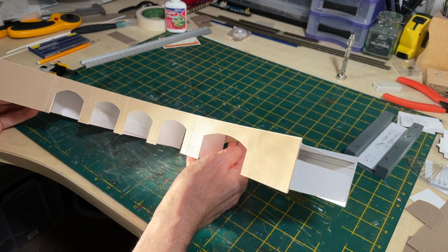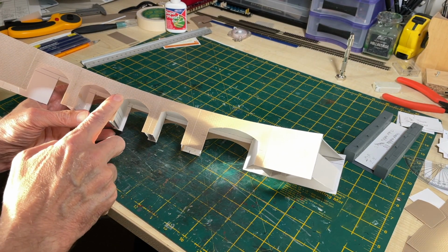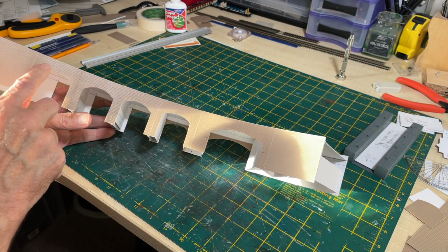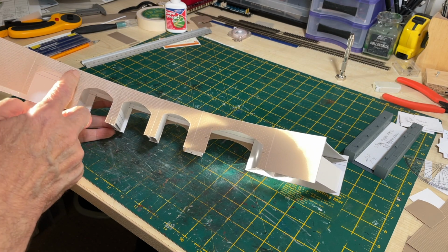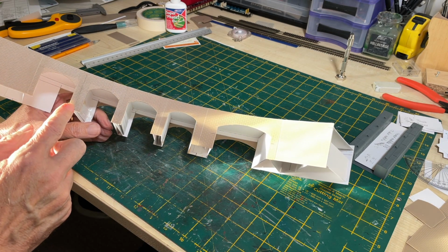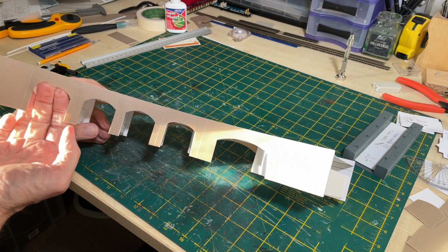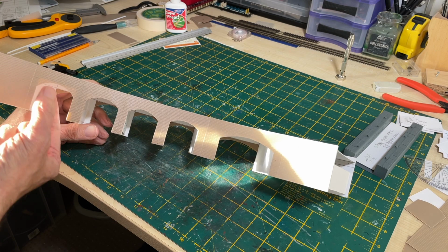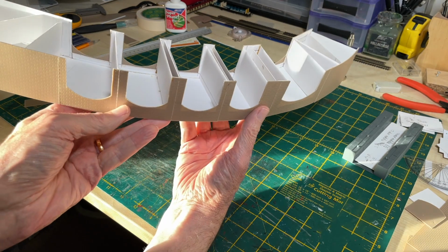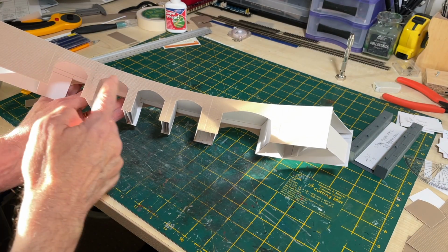What I then did, as I said I would do, is to cut each of these sections in as bespoke. That was all cut from one length, so that the cuts down the centre would marry up between each section, but they were measured specifically to fit the gaps that had actually been cut. You probably can't see here, but if you get the light behind it, you can see through where the square goes over the top. If I turn these the other way up, you'll see that the portals are cut square. So those were the ones that were done first.